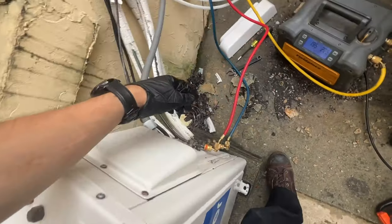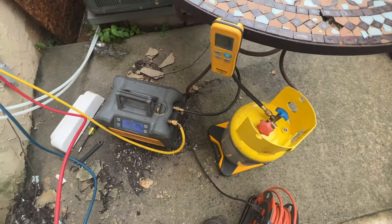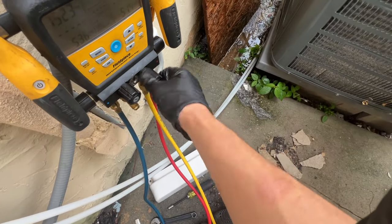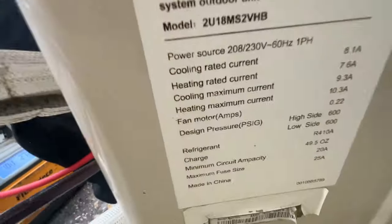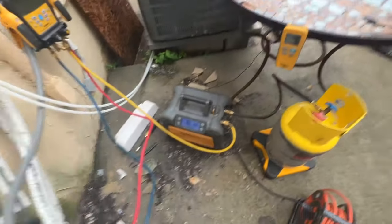So we're hooked up for recovery. I connected to both loops for both heads, hooked up to the gauges, purged out my lines through the recovery machine and up to the recovery tank, opened up, and now we can start the recovery process. We're weighing out just to see how much we take out. Our unit information is in the back — let's see what it says for charging: 49.5 ounces. Hopefully that's what we take out, and that's what we'll be putting back in.